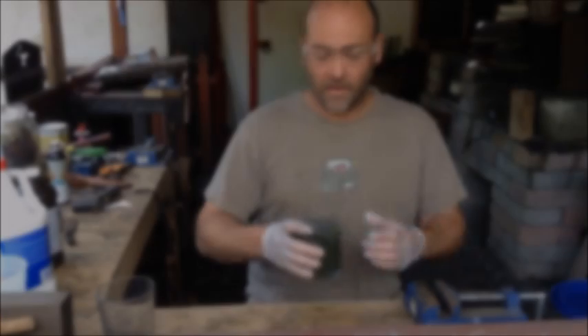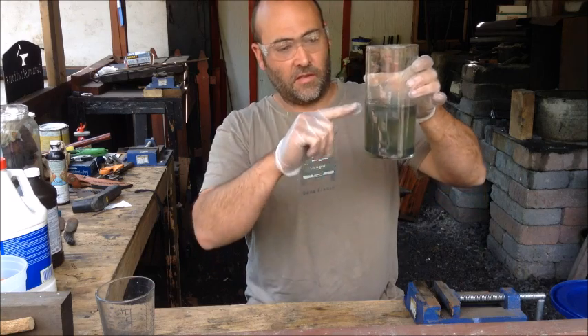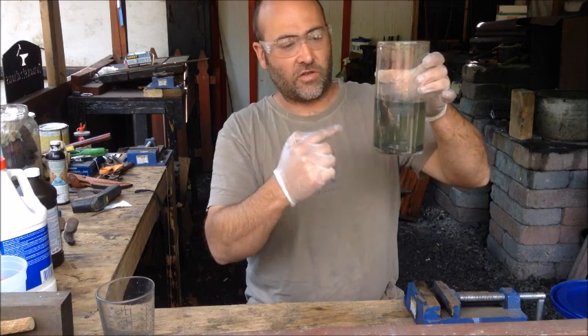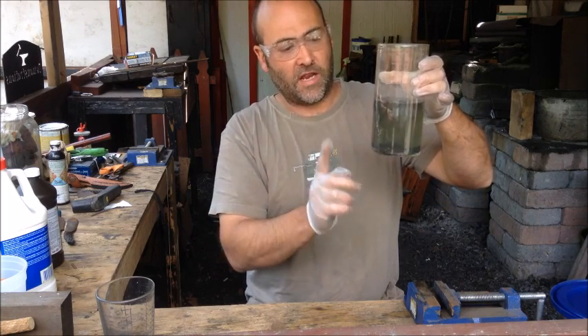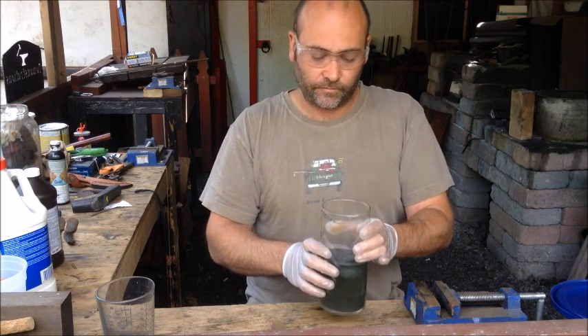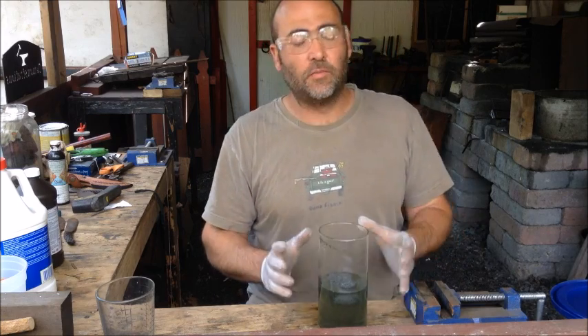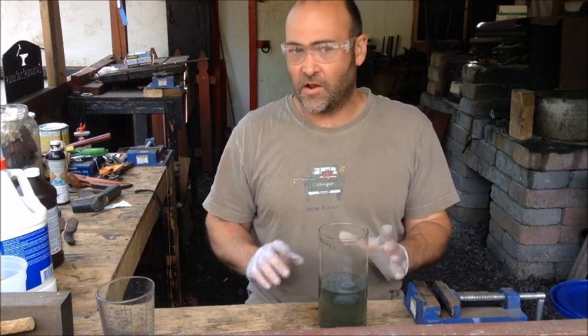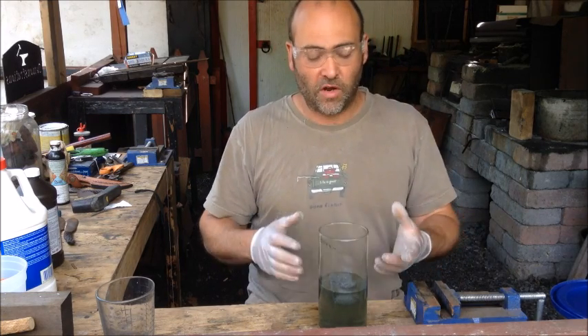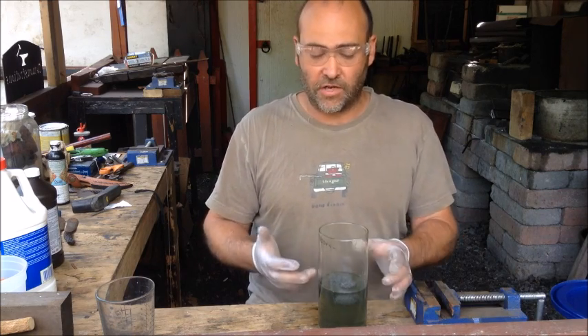For expediency's sake, I started this batch last night. You'll notice that most of the steel wool has actually been dissolved, and we're taking on sort of a grayish blue color to our muriatic solution. It's good to point out at this time not to have any open flames nearby, because one of the elements released is pure hydrogen from this reaction.